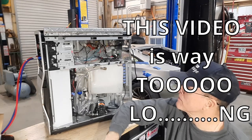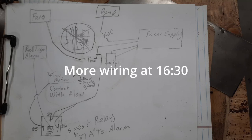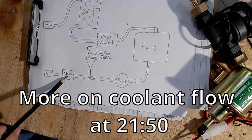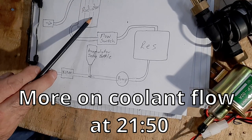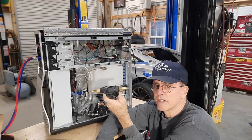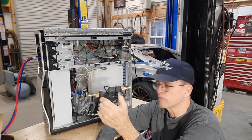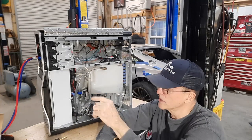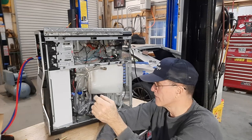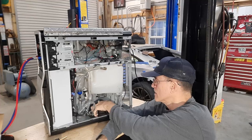As promised, I am re-uploading this video now that I've got it to work. Anyway, this is the pump I started with. It is a centrifugal pump. It does not have any pressure, just flow, and it does not have enough pressure to push fluid through the torch head at a rate fast enough to turn off the alarm. So I had to go with a stronger pump.